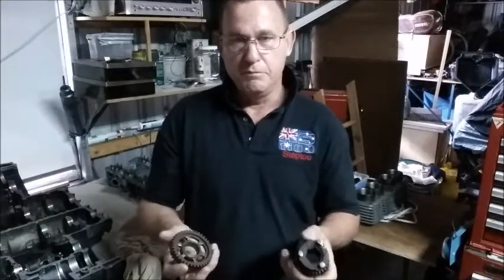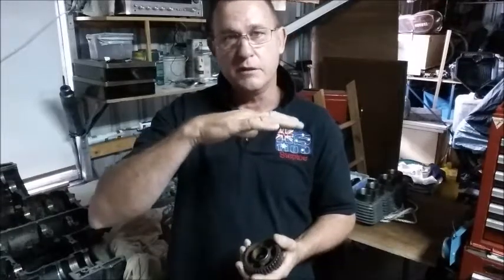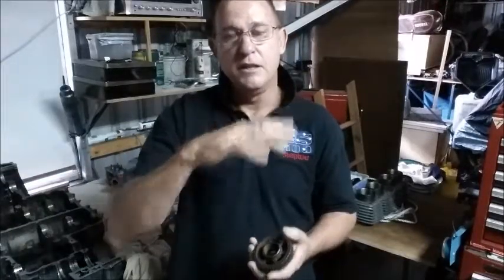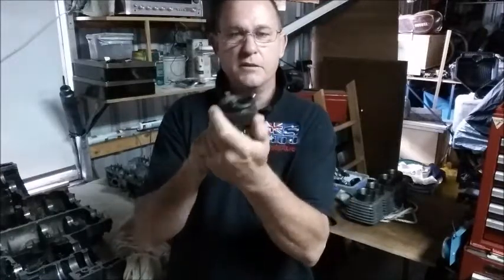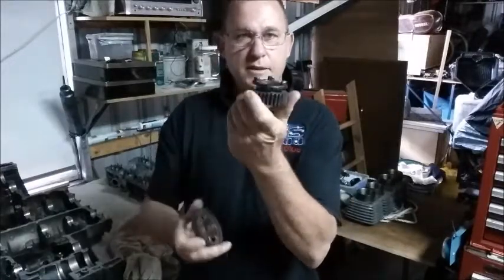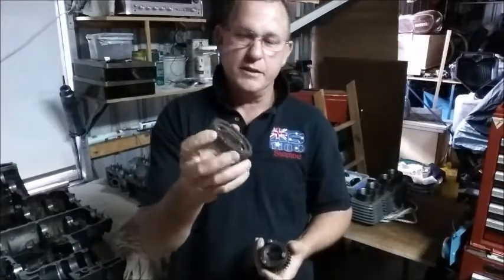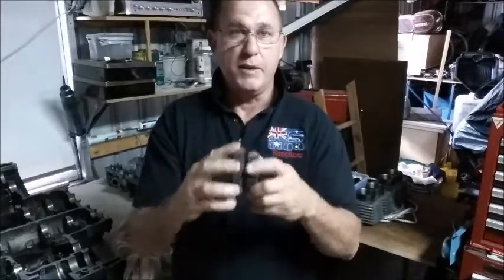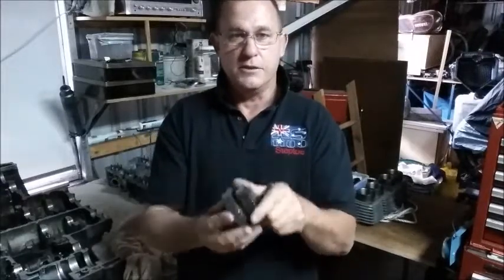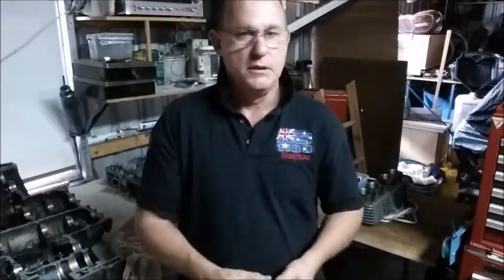and then we're going to set the base of the pedestal drill, kick it up on an angle, and with that one angle we can do every single one of these dogs at the exact same point. Then we swap the angle around on the other side and we can do the corresponding ones, and that will give us our back cut gears. It's cost us nothing, just $20 for a die grinder bit.